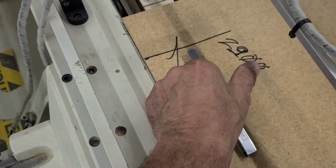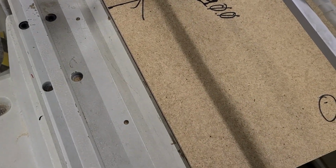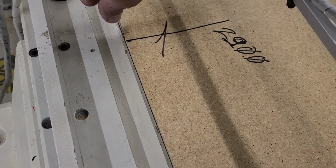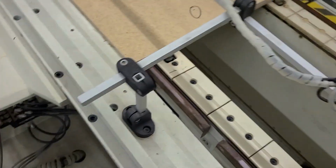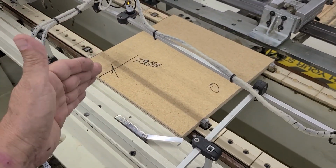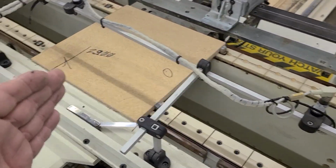I'm on my saddle, and I went through and I found with the feeler gauge which one it was that drug up to this line, so I'm using that as a reference point. When I come up to here, I find that, and this is 0.23 millimeters, so that when I advance my next dog up, which will be dog number 2, I'll set that relationship to the same there. Dog number 3, dog number 4, dog number 5, repeat till it's done.